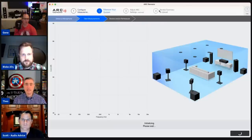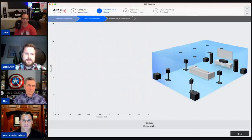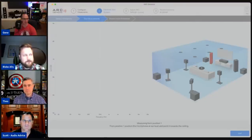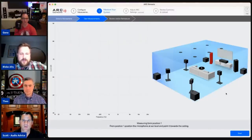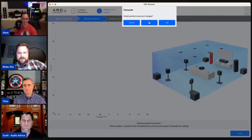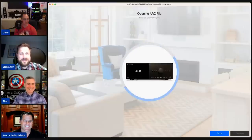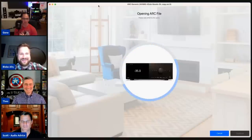A quick question: in the final release, do you actually see the physical speaker distance when ARC runs? Yes, in the final release you do see it now. The relative distances in the earlier versions were confusing — people would call and be confused, but it was correct. Now with absolute distances: if the subwoofer distance looks different from the physical distance, most likely it's because of DSP processing internal to the sub — it's the acoustic distance, not the physical distance, typically around 10 milliseconds of delay.